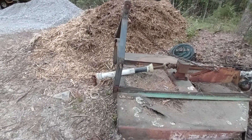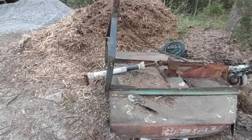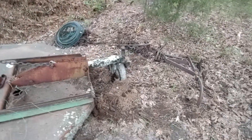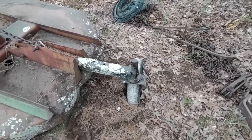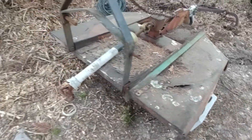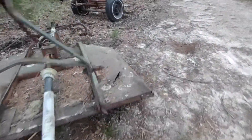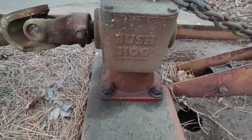...PTO shaft. I think it needs a new PTO shaft — I can't get that one to stretch or shrink and it won't quite reach the PTO. But this back wheel here was kind of stiff, gave it a little shot of red grease, and it works just like a new one now — spins and flips. Got a couple little nicks in it, but for free I'm not going to complain at all. And as you may or may not be able to see, it is actually a Bush Hog — it's not a knock-off brand. So I got a good one.